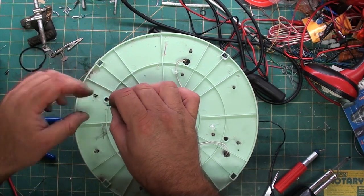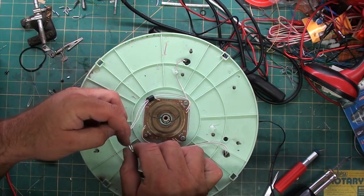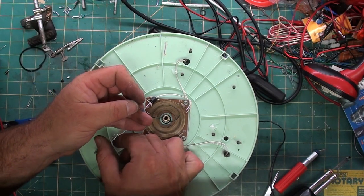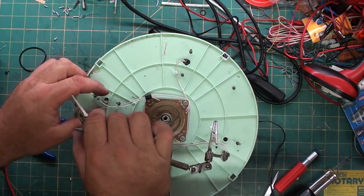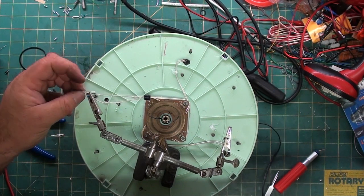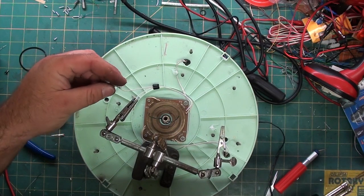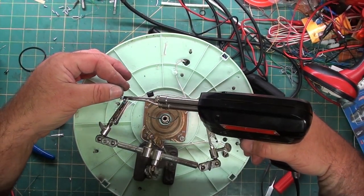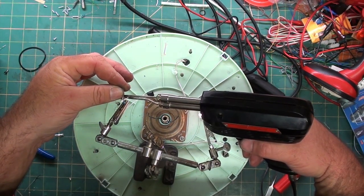Probably thinking you're gonna leave these bare wires exposed on the ends. No, once I'm done, I'm gonna coat everything in liquid electrical tape. I would use normal heat shrink, except that doing so, I have the issue of them dry rotting, because it's going to be in the elements. Liquid electrical tape has a little bit better longevity outside.